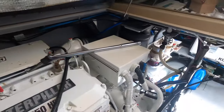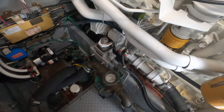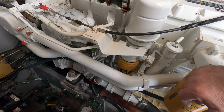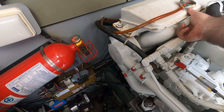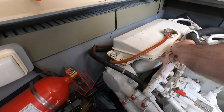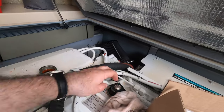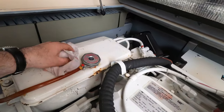While you're in the engine bay, it's always a good idea to do a general look-see to make sure everything looks okay after winter. Even though the engine hasn't been running under pressure, once it starts up — probably in another week or two — that's the time to check for any leaks or anything unusual. Check your hoses: if any soft hoses seem overly soft, now is the time to replace them. The time to replace them is not when you blow a leak underway.